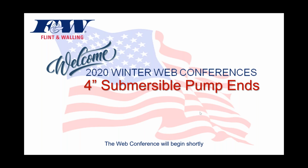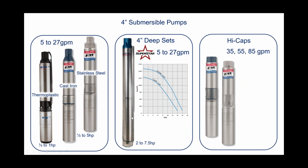With that, we're going to go ahead and get started, and I'm just basically going to walk you down through a Flint & Walling submersible pump end. When we look at these pumps, especially the 4-inch submersibles, I just wanted to throw this up here real quick because there are a variety of these that we offer. On the left-hand side of your screen, you'll see our 4-inch subs that range from 5 to 27 gallons a minute. The cast iron and stainless steel submersible pumps will go from 1/2 to 5 horse.